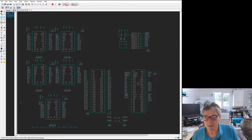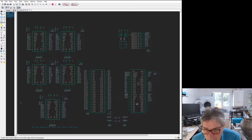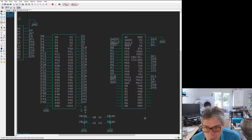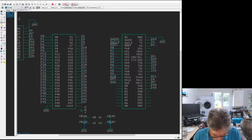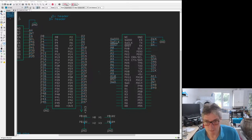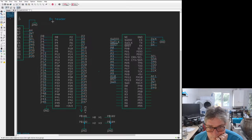So anyhow, let me go into this in particular. If we were to do the black edge version, like an ECP5 black edge version that fits into this very same board, then these reserve pins here, R0 through to R8, could be used. Okay, noted, Laurie. And in fact, whilst I remember, let me put this down here next to the 5 volt.